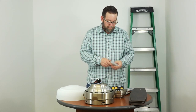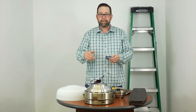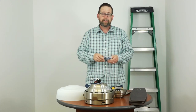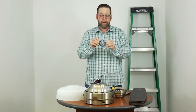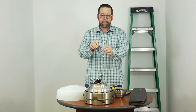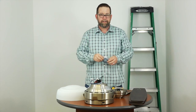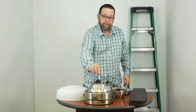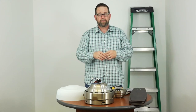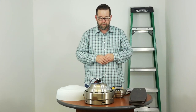You're also going to have a hardware pack with all the blade attachment screws. Since this is a dual mount fan, you can hang it on a flat ceiling or an angled ceiling. If you hang it on an angled ceiling, you're going to need an extension down rod, so they've included this handy dandy wire here — this is going to easily connect to your fan and then connect to the remote receiver, giving you the extra wire length needed for the extension down rod. Otherwise, the wire is already trimmed and good to go right out of the box — no wire trimming and stripping needed.